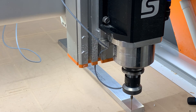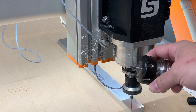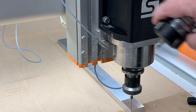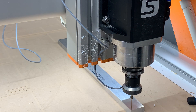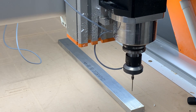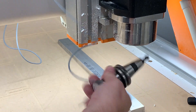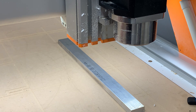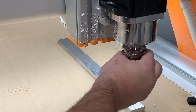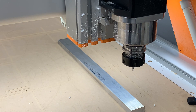The first end mill I'm going to use for this job is a hole-spotting end mill, as you can see right here. All I want to do is spot the center of the holes on this workpiece. Now that the probe is done, I can raise my gantry, press the button to eject the touch probe from the machine, and unplug it. Then I can simply pop in the new spot drill and go ahead and run my job from there.